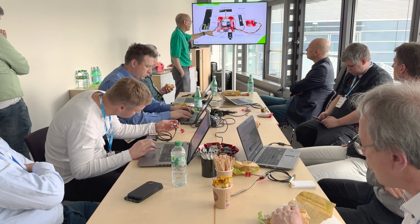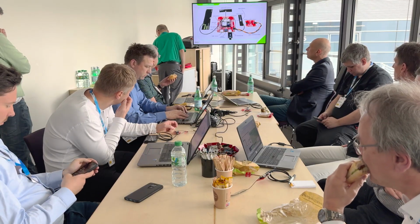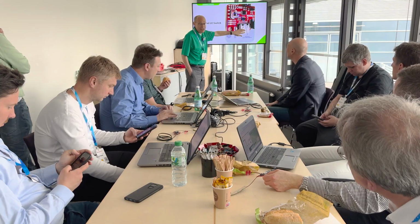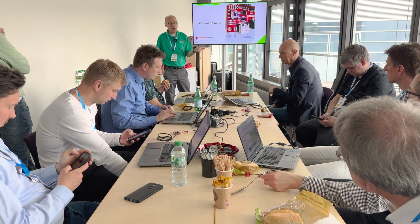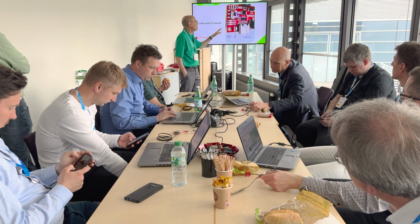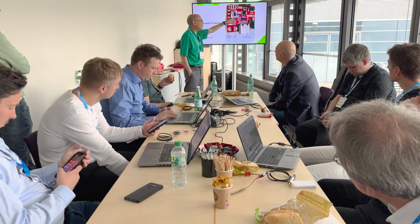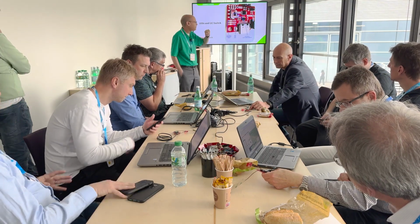I do want to point out there is a switch on this side of the board and some lights, and let's take a look at those. So the switch switches between this second USB-C connector, which is used for updating the firmware on the modem or direct access to the internal cellular component, or I2C, because they share pins. So you just want to make sure that the switch is in the down position towards I2C because that's the way we'll be using it today.